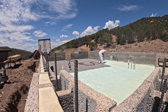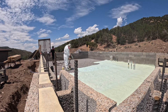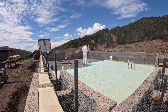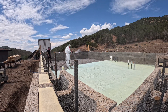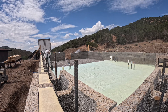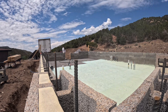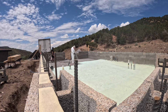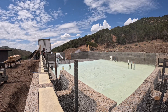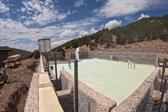As we went through and did the spray foam, it came out pretty level — maybe an inch or so out of level. There's kind of a deep spot where the bathroom will be, and actually with the concrete slab I ended up having a little bit of a depression there too, maybe half an inch. Hopefully that will be fine under the bathtub. They came out in the morning and did it in a couple of hours. Hopefully it provides a nice warm base for the radiant floors.